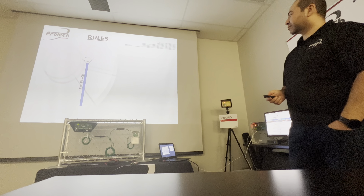The infrared tower must be 50 centimeters higher than the top of the fence. The reason is that if someone puts a ladder to climb over and the tower is not high enough, they will not be detected. By placing it higher, you have a security safe zone. The distance between the fence line and the first transmitter/receiver is up to seven feet.